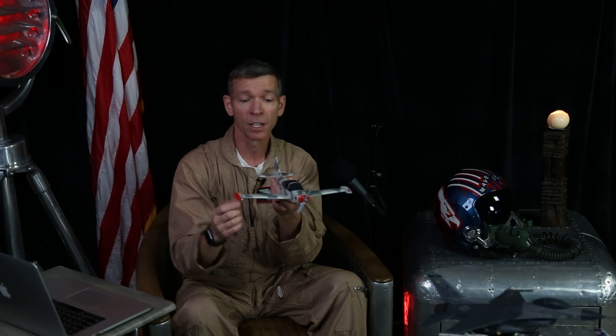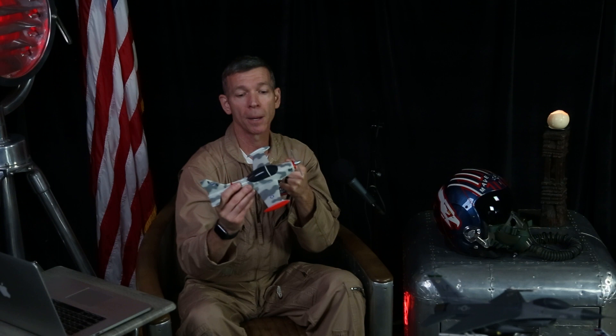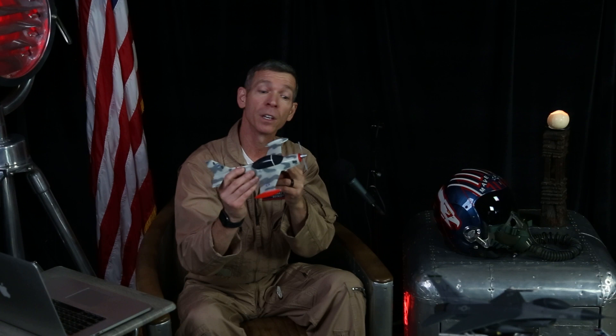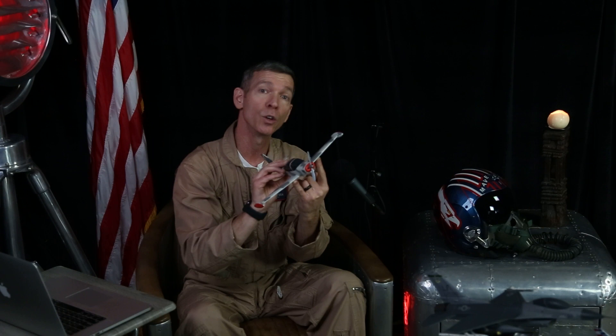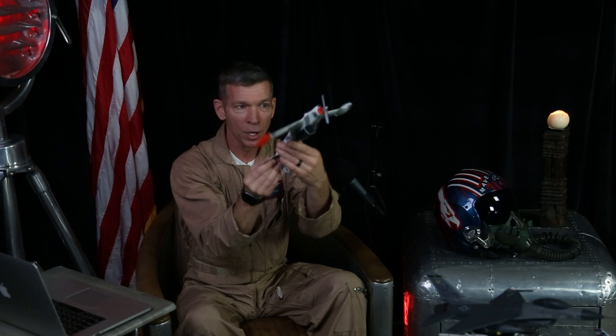It's a great pre-jet airplane — it flies a lot like a jet. It's fast and has a very thin wing, which allows it to go really fast but doesn't make a lot of lift. You'll find it reaches its critical angle of attack with a rumble and buffet, just like a jet wing does. As you start to pull the nose up and put some G on the airplane, you'll start to feel the rumbling and buffeting in the wing root area as the airplane approaches the stall. The more you continue to pull, the worse it gets.